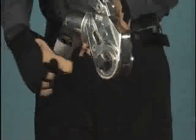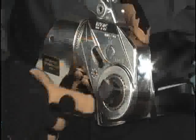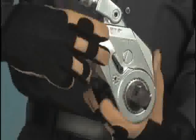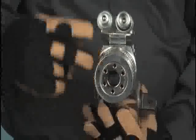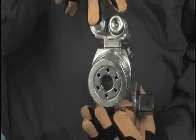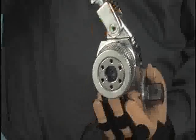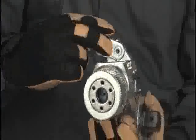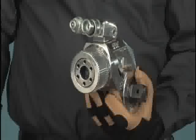This is a square drive style hydraulic wrench. Inside the unibody housing is the hydraulic piston. The two supply hoses connect to a 360-degree by 180-degree swivel that allows the wrench to fit into tight places and keeps the fittings and hoses from being trapped against an obstruction and damaged. There are two hoses because the piston is driven forward and then returned by alternating hydraulic pressure as the pump shifts the direction of the flow.